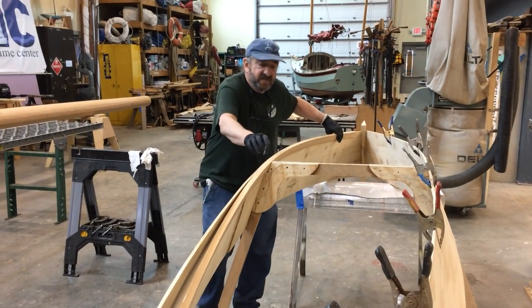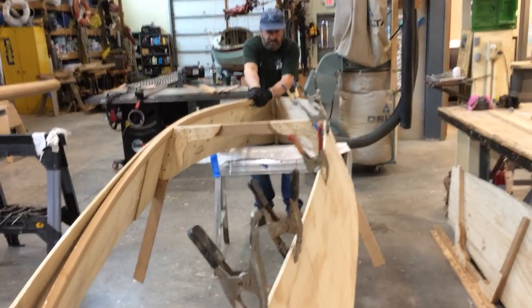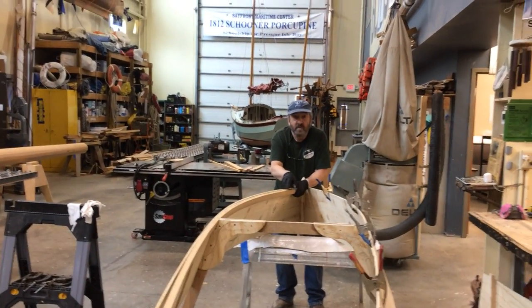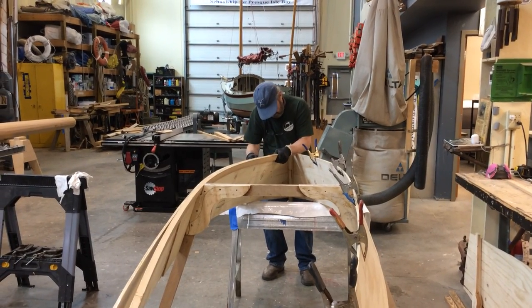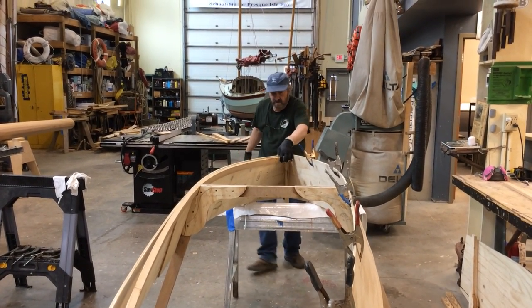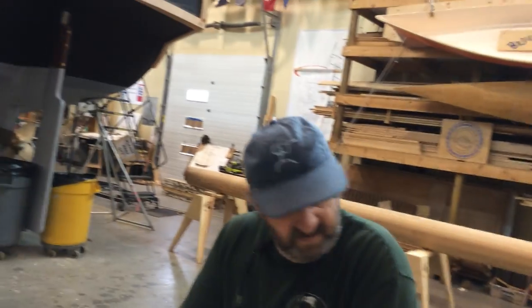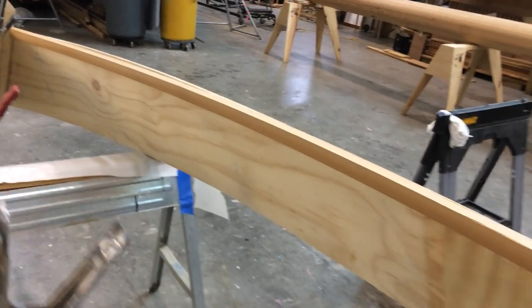It's sort of hard to move because it's jammed in this joint. Let's try pulling again from here. There it comes. It needs to come my way a little bit more too. I think it still needs to come my way a little bit more. I like that. I'm going to grab a mallet because we're going to have to tap this up a little bit to get it right where we want it. This mallet is a rawhide mallet — it's got rawhide in the ends and some weight so you're not marring up the wood, but it's heavy when you're bumping on something.